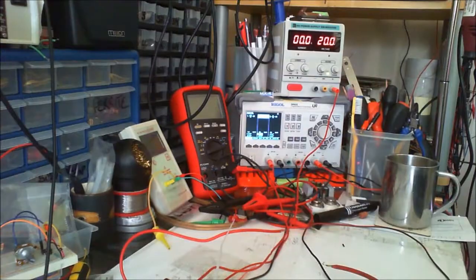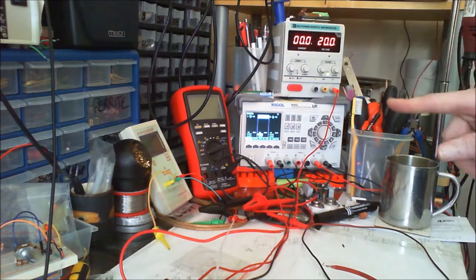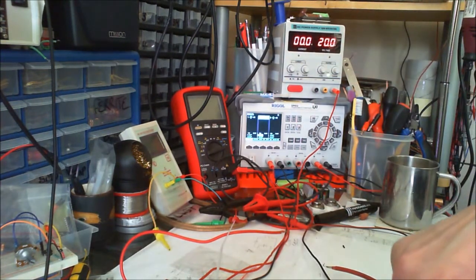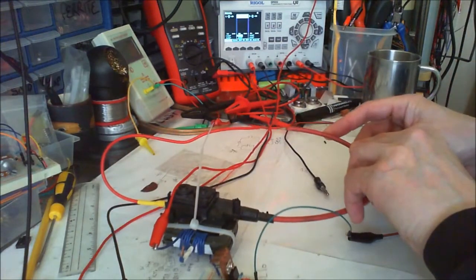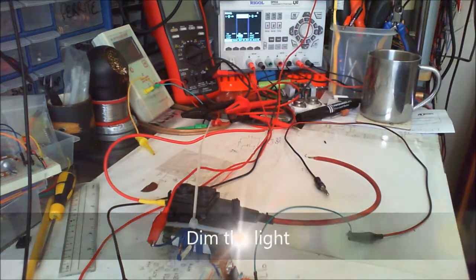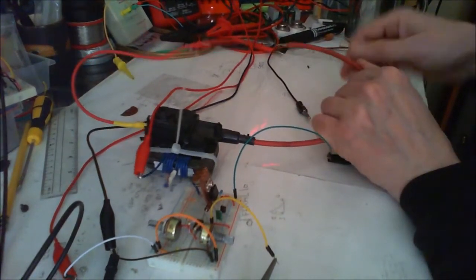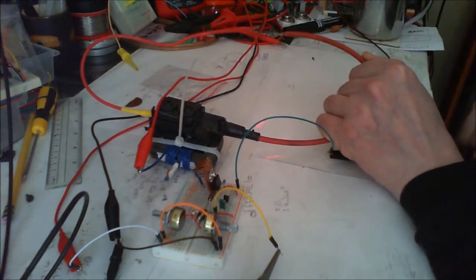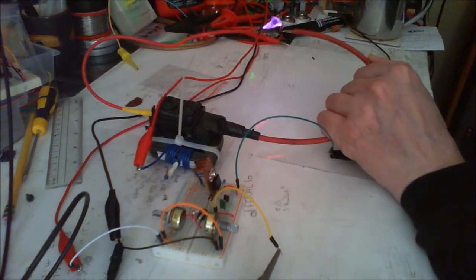What I'm doing now - I've just been testing on this but I'm shifting up here now. You've got more amps coming out here. It worked at 24 volts; I've got 20 volts there, and this is just being powered by this part: 11 volts at 200 milliamps. So 11 volts going into the 555 circuit and 20 volts going into the flyback. I'll just plug in the flyback because that's a switch and it's not going to do anything until I start turning the gate.